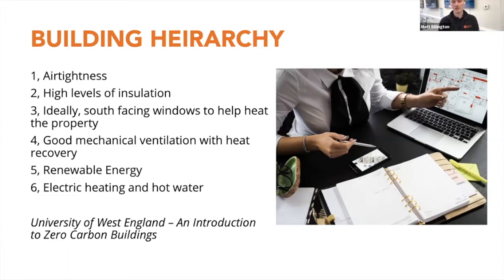That's the most renewable way to do it, and that's where we see massive reductions in energy usage and CO2 emissions. So if I was building my house now, I'd be looking at air tightness, obviously high levels of insulation, probably not pushing to passive standards, but getting really, really close to that, because that's what's really going to save money and save CO2 and energy usage.